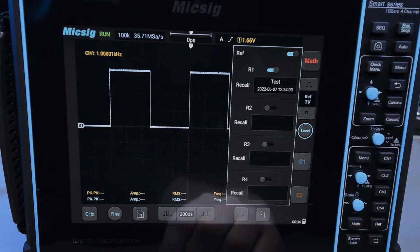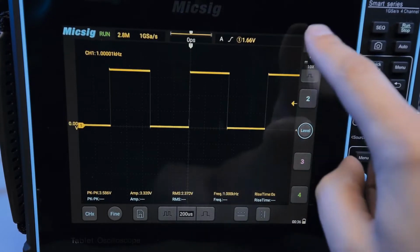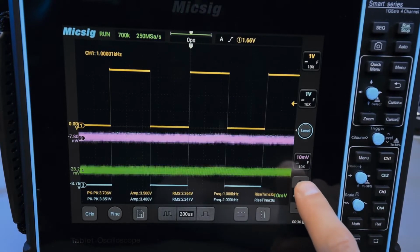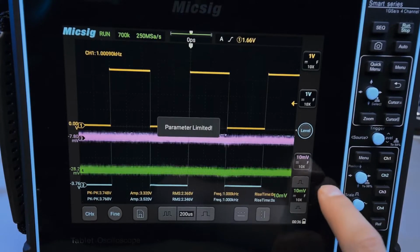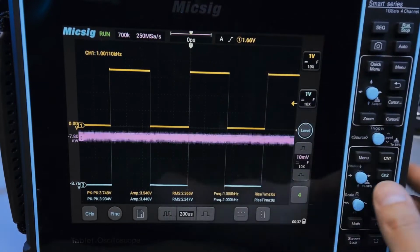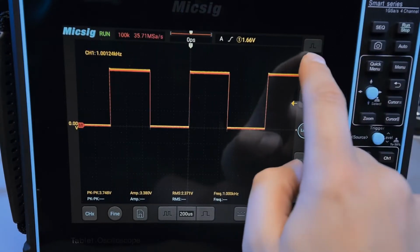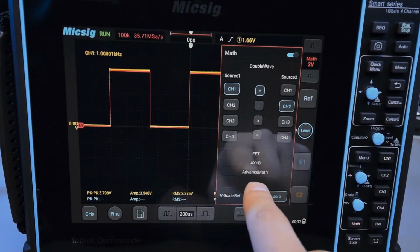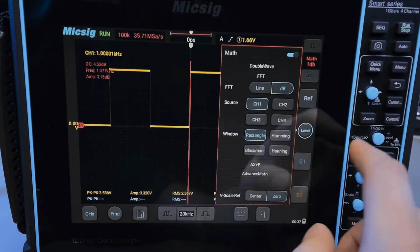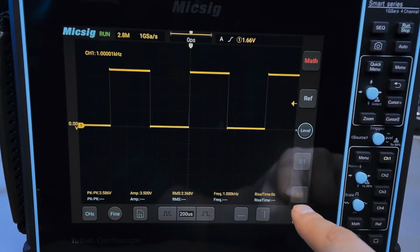But anyhow, that's kind of how you navigate this whole thing. It's a little bit cumbersome. You can get used to it. Now, I did something just now, which you might have noticed, which is that I swiped vertically on the channel bar. Of course you can select your channels by just clicking on them like this. You can't click on it again to just disable it, which is really interesting. You have to pull it out and then disable it this way. That's very cumbersome, so I prefer to just press the buttons. But if you swipe vertically on this bar, then you get the math operations, and that's where you have, for example, FFT stuff, advanced math, and various channel things that you might choose to do. And here are your FFT settings for different features, and I'll show you that a little bit later. Just as well, you have your serial 1 and serial 2 decoding, which I will actually show you next.